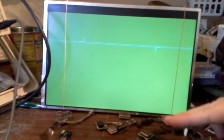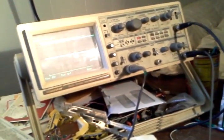So what we're seeing now is you can see the screen refreshes briefly, and then it pauses for a while, and then it refreshes, and then it pauses. So what's happening is when it refreshes, it is in free running mode during that refresh, and then once it reaches the end, the AVR intercepts it and stops it from free running, and then starts a windowed repeat. So these cursors select a window of data, and that window is repeated 100 times, and that can be seen over here on the oscilloscope right now with better lighting.